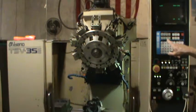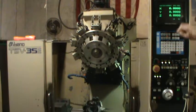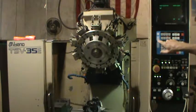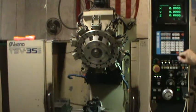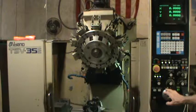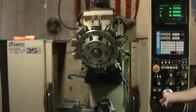Since I'm in the X-axis right now with this selector switch, when I turn the jog wheel, I'm going to see the position by pressing the POS button — or position button — and here's our XYZ position. I'm going to hit the POS button to get to the position axis screen. This is all zeros right now because we just homed it. I'm going to move in the minus direction on the X-axis, back around halfway of its travel, which is 20 inches of X travel, so I'm going to move it to around 10 inches with the hand wheel.